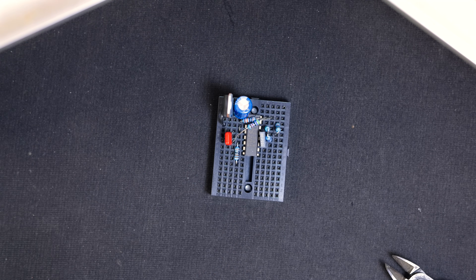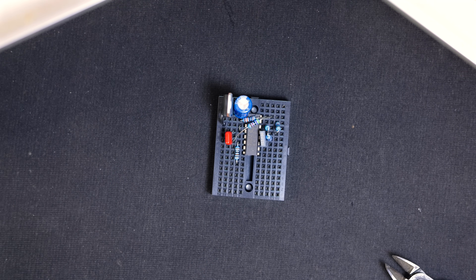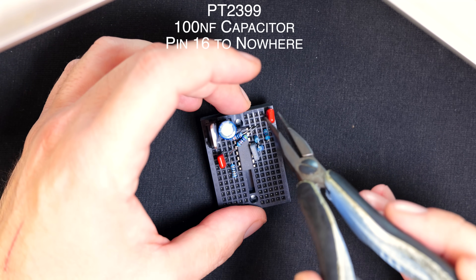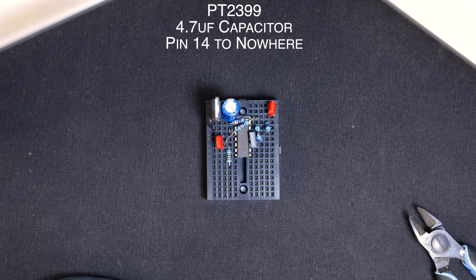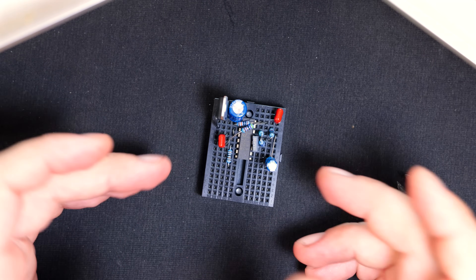It never looks that fancy when you're doing it on these proto boards but the cool thing is you can just build stuff so quickly without soldering. I'm just putting it on as I see it on the schematic. Here's our input coupling capacitor — this is a 100nF and this is going from pin 16 to just nowhere, just to the air. We don't want anything else connected to the other side of that because that's where the input wire is going to go. Then our output capacitor is 4.7UF. It's a very moddable circuit — you could kind of go nuts and do whatever. Okay pin 14 to out. I've got a parts list down in the description.